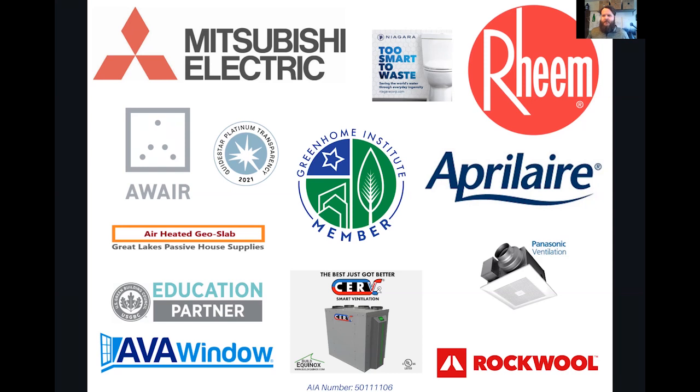Trying to engage people, I think some of the things that can help are the tools coming online that allow for fault detection and diagnostics, and predicting when equipment is going to fail, instead of having an emergency replacement. I think that's a huge issue. People will go with whatever's on the truck because they need heat. And if that's an 80% gas furnace, then that might be what goes in. Not many people are carrying air source heat pumps on the back of a truck. But if they know their furnace is failing, they can be more educated and in a position to make an informed decision, and sort of lead the contractors along, kicking and screaming if need be.